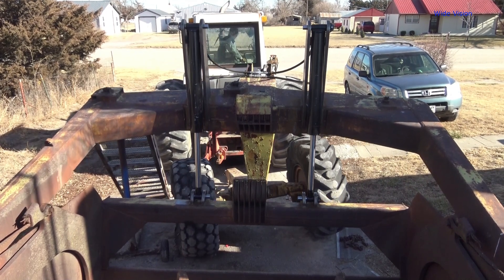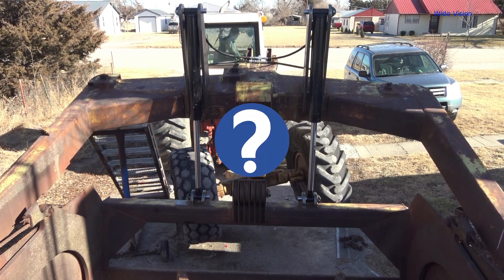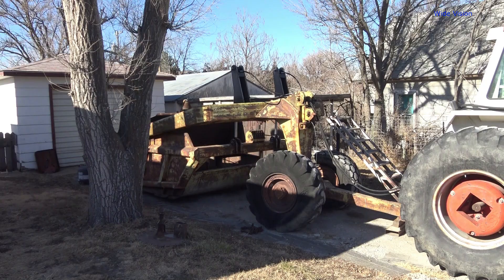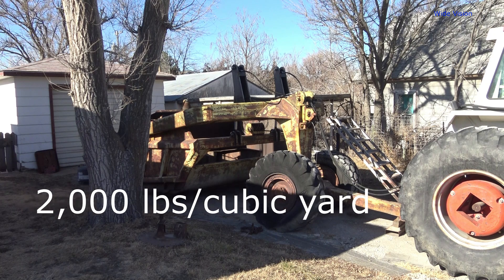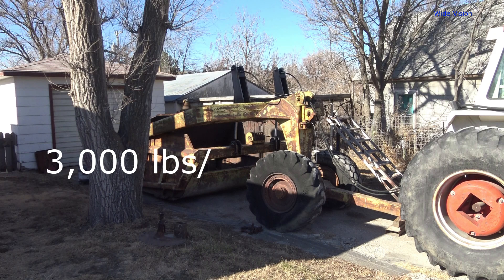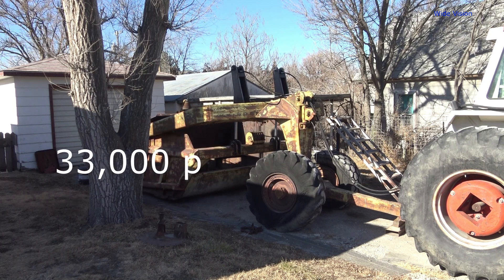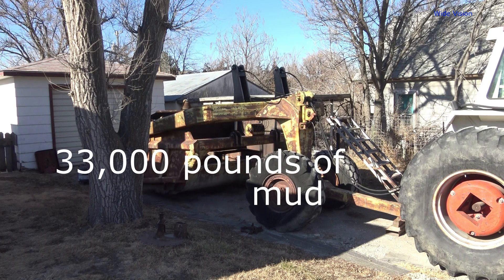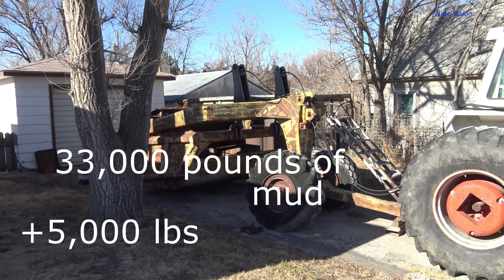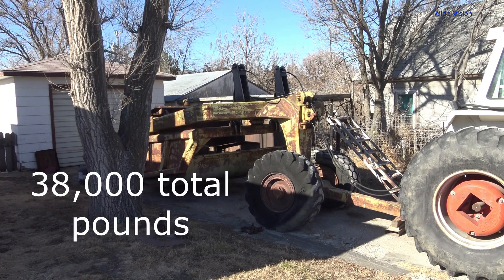There were a few things I needed to know to answer that question myself. We'll start with the bowl lift cylinders. First thing I needed to know is how many pounds are they lifting? According to what I could find, dirt weighs about a ton per cubic yard in our area. Some people said wet dirt might weigh as much as 3,000 pounds per yard. I'm calling this scraper an 11 cubic yard machine, so that's 22,000 pounds on the low end, and maybe as much as 33,000 pounds if it's mud. Plus there will be the weight of the bowl itself — just as a guess, probably around 5,000 pounds. Add that together, and there is the possibility of lifting 38,000 pounds.